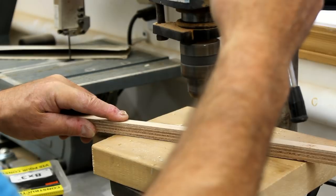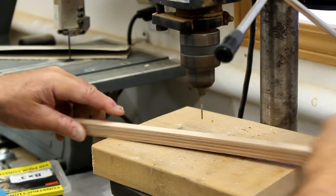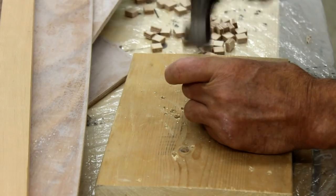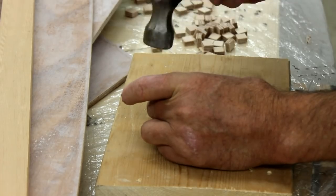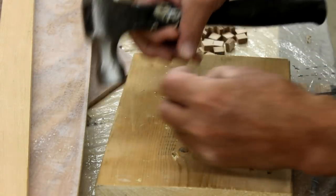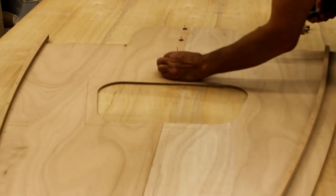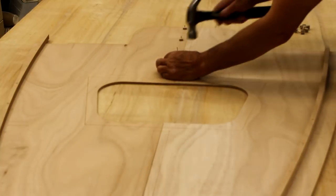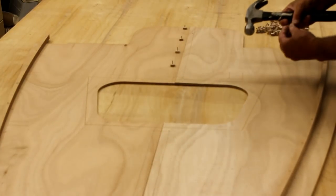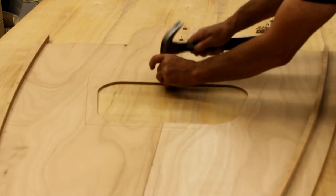On the drill press I'm just going to drill holes on all my marks so that my finishing nails will cleanly and easily go through the wood and not be nailed into it. Then I'll preset my finishing nails and all my little three quarter by three quarter pads by hammering them through with a hole in the piece of wood. So I'm just taking the little pads with the nails in them, putting them on the marks and tacking down one half of the forward seat assembly to the table.